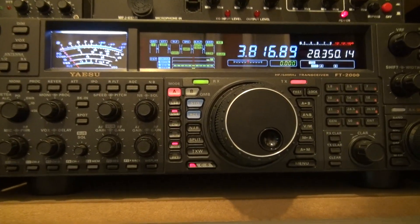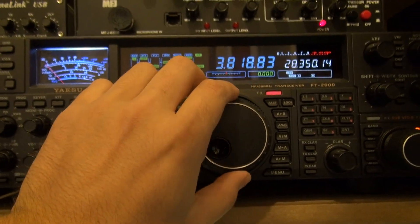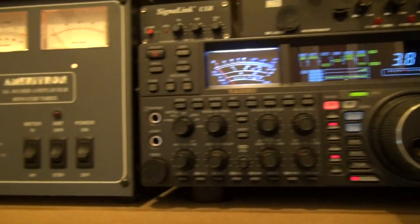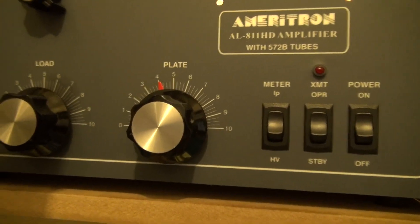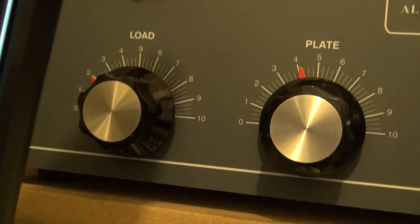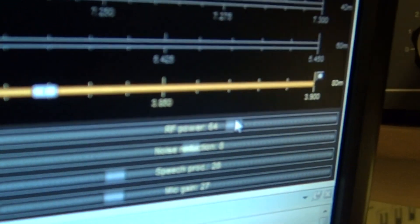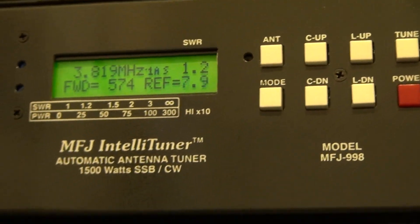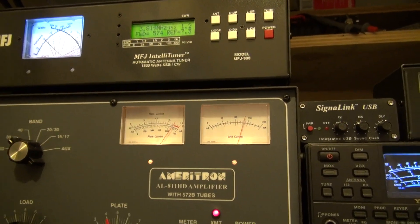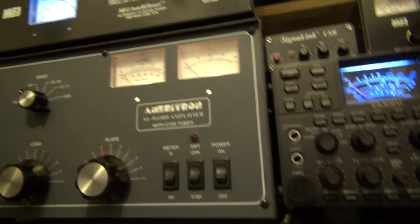There's a little update on the video I just did on that G5 RV amplifier issue. Where I've got the loading plate set is about two and four, somewhere roughly in there, and I'm putting in about 65 watts. It's working now — I tried this last night and something was not working out.